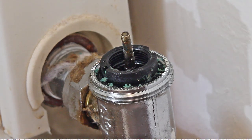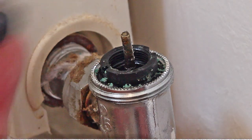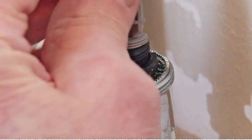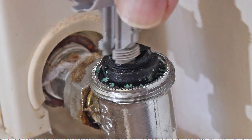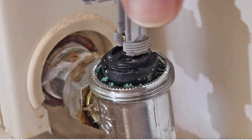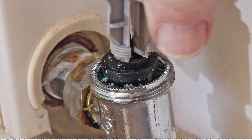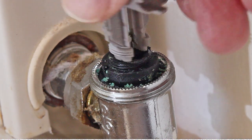Here's the new seal — silicone grease in the hole. Now we'll screw that in using the proprietary Drayton seal and balancing tool. Just get my head out of the way if I can, and just do that seal up. You don't have to wrench this up — it's a little bit fiddly, but it certainly is for me.